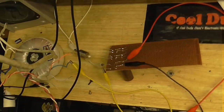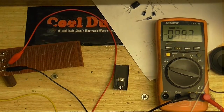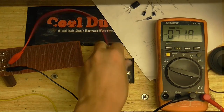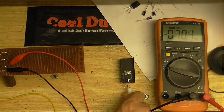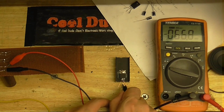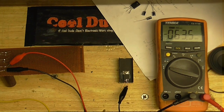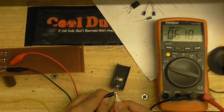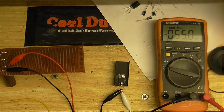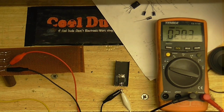And I thought, well, I've got half of a power supply cobbled together here, so might as well use that for the voltage supply, why not? So let's test these voltage regulators. This is the LM7812. Right, so I'm going to put my meter's negative on the ground pin, and the ground from the power supply is also going to connect there. Oh, that is a terrible connection. That isn't even clamped onto the wire. Right. Because these were salvaged out of something, so... And I've had these laying around for a while, so I don't even know if they're going to still work.